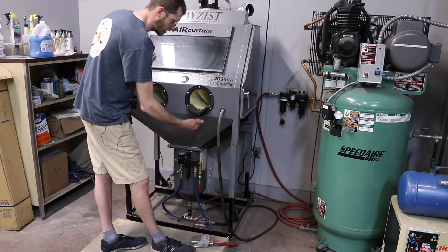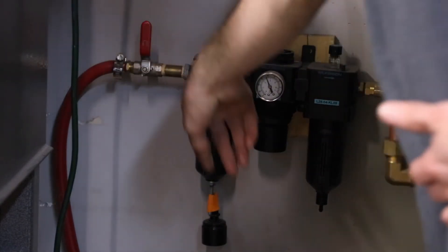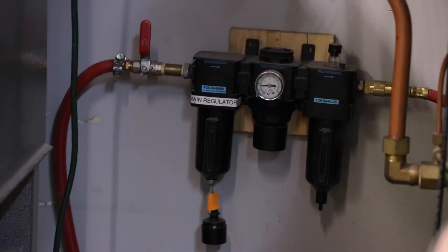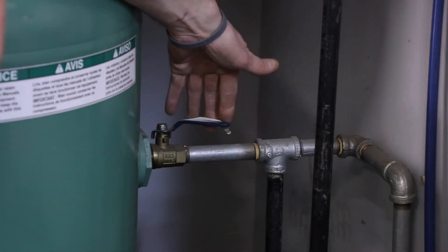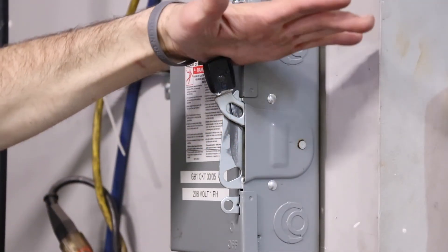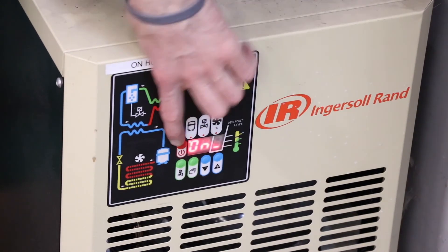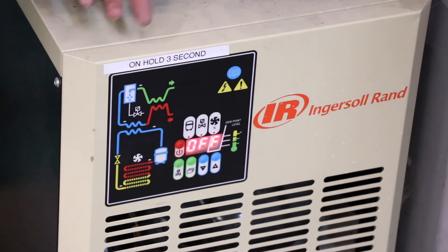After that, we're going to go and close the rest of the air valves. The next valve to turn off is this main regulator valve — that will stop the incoming air from the compressor going into the main regulator. Then we're going to move over and close this air valve that goes from the compressor to the full line, as long as nobody in the hot shop is using the air. As long as nobody's using the air in the hot shop, you can turn off the air compressor. You can also turn off the air dryer system to save a little electricity by holding that button down for about three seconds. You can turn that off even if people are using the air in the hot shop.